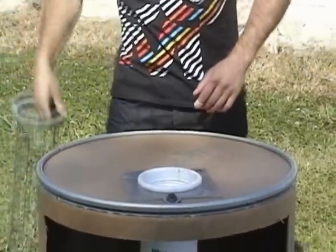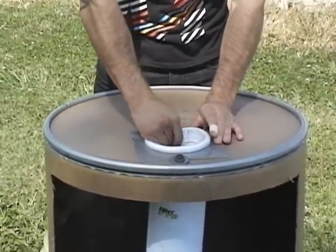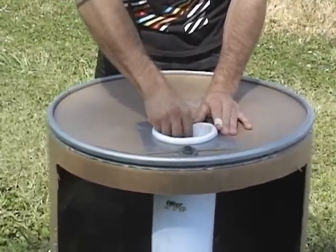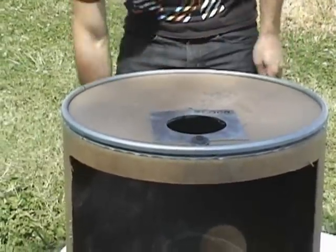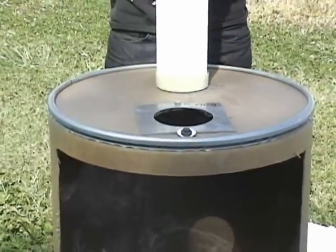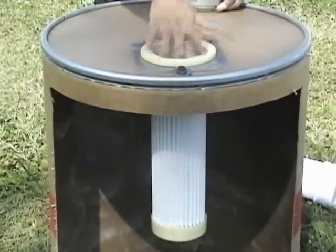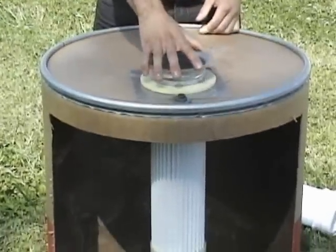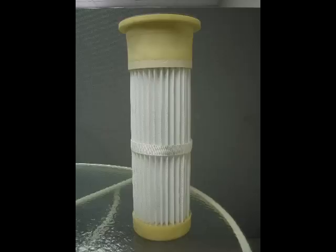After you take your blow tubes out of the collector, remove your cage, and take out the old snap band bags, install your new cartridge, press it in, put your metal seal in — and I usually step this down and push it down with my foot.